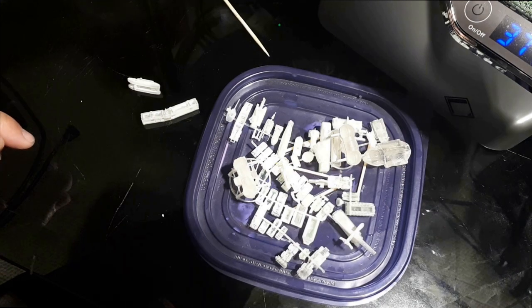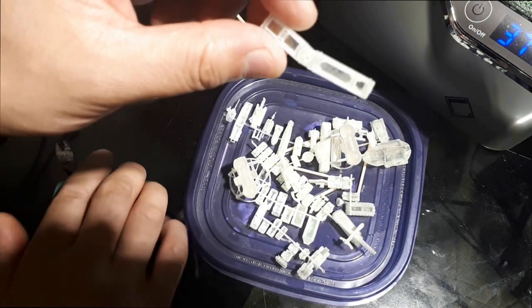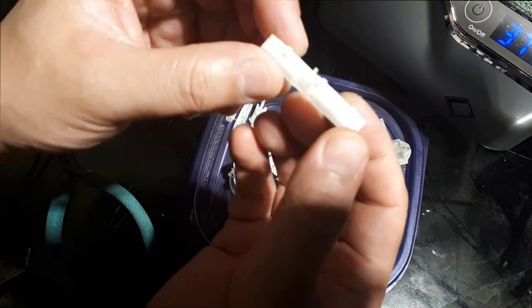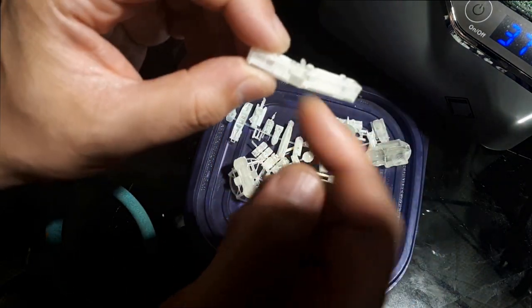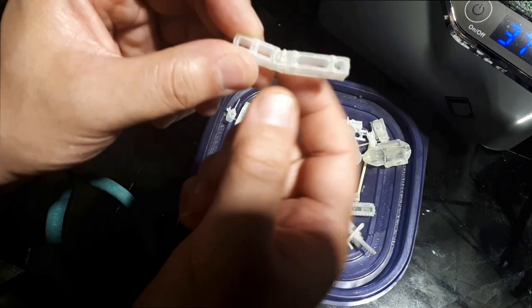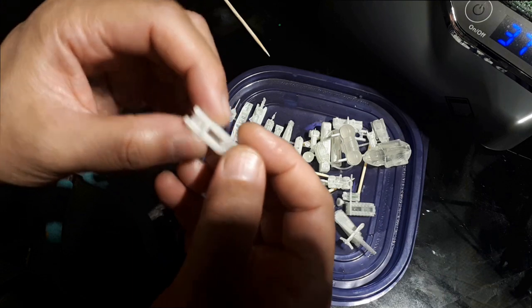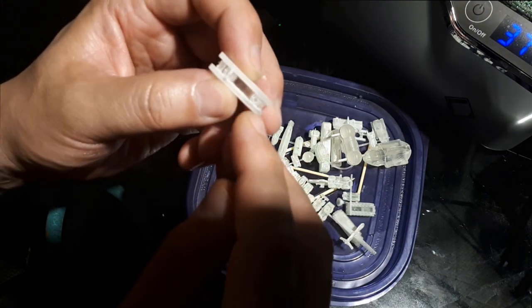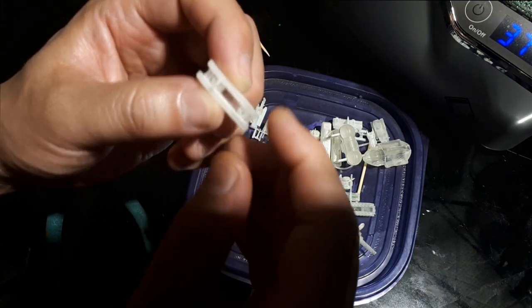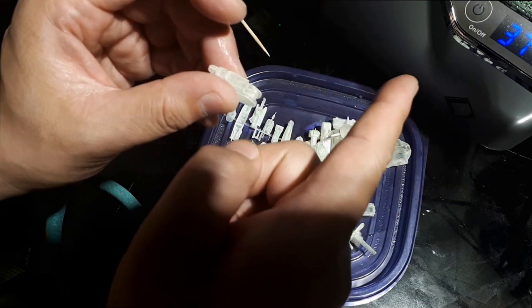I thought I'd share some of the clipping process. Here's a prime example of keeping the sprue, because it's keeping this articulated bus together. By clipping it wider than the pivot, it's trapping it, right? But be mindful, I don't have that on everything. Like this one, you can see the circle. Once that wax comes out, that turret's going to be a really tiny piece hidden away in that bath.